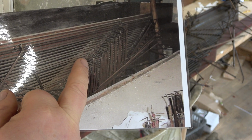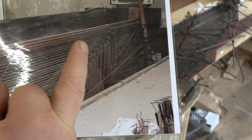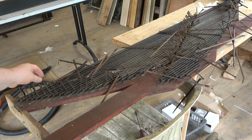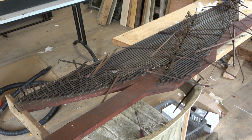They're held in with pins. I bet the pins are iron, and so they'll need to come out and be replaced with phosphor bronze. So that's how it is. And without this being overhauled, you can end up with pins breaking, pins seizing, and so on. And what happens is that I'll just move across and hope that what I'm going to show you is in the camera.